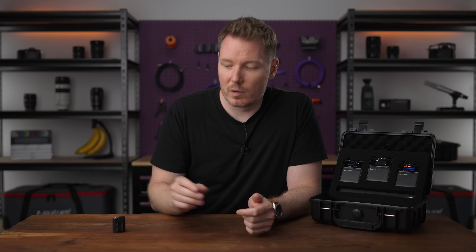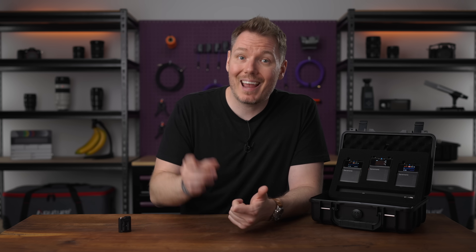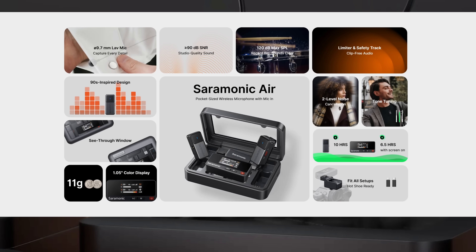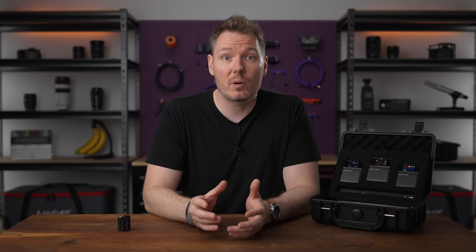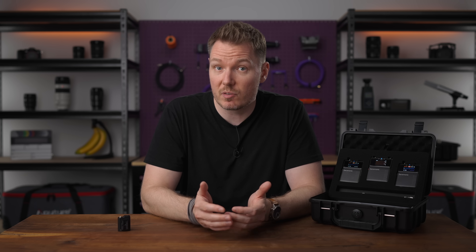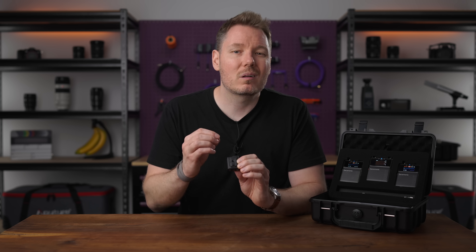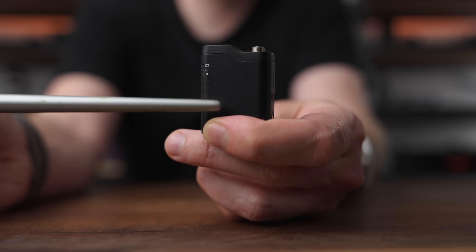This explanation wasn't intended to dump all over these compact 2.4 GHz mic packs. I think they serve a real purpose and are a great value option for content creators, live streamers, and online educators that have a clear line of sight between themselves and the receiver. Saramonic even makes several products in that class, including their newly launched Saramonic Air. It's just about finding the right tool for the job. The ease of use on these little 2.4 G kits is unparalleled and in many cases will be perfectly sufficient for audio quality and signal integrity. My only reason for comparing them was to highlight the reasons why digital UHF exists beyond just being bigger. However, when it comes to size, the smaller and tighter you pack sensitive components — each of which generate some electromagnetic interference of their own — the more likely you are to introduce cross-talk between those components and the less space you have for appropriate shielding and antenna separation.